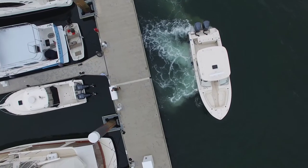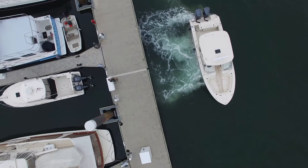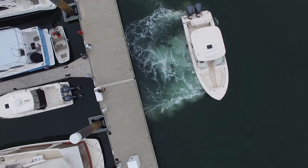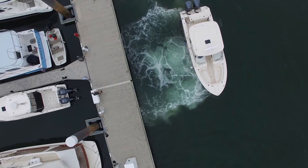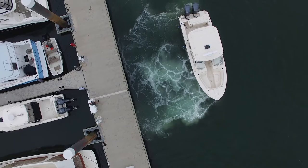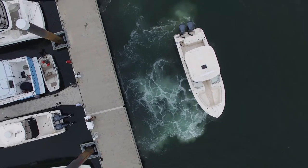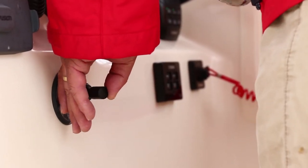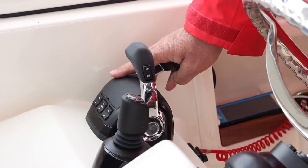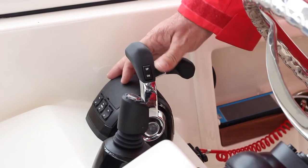So now what happens: I've got the side force and the moment — the twist — of the two engines, one going ahead and one going to stern. The side force of those props really wants to twist the boat and turn it in its own length. But so that we don't do that and instead just move the stern out, I'm going to turn on the bow thruster at the same time. The bow thruster is going to push the bow of the boat out, and the engines being opposed to each other — port ahead, starboard astern — is going to pull the stern out.